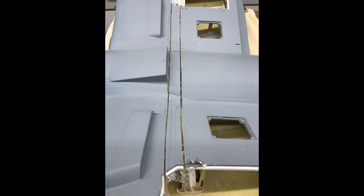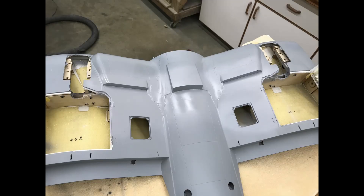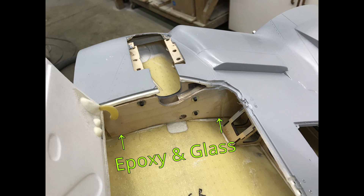When it's done, you're going to see there's still a gap after we pull the tape off — and that's all right. We're going to take a syringe and use five-minute or 30-minute epoxy, wet a finger with a little bit of alcohol, and rub it down. Smooth everything out, rough-sand it just a little bit, and put a little gray primer on it. When it's all said and done, it's pretty good. We'll also see additional spots where I'd recommend going in and glassing — put extra glass cloth right up in there while you're there. That part is pretty well on the downhill slide.